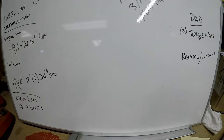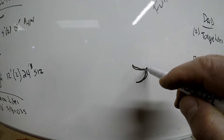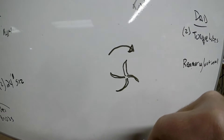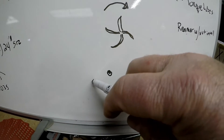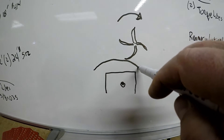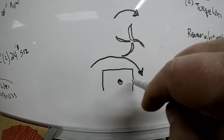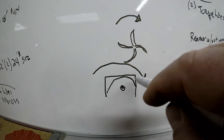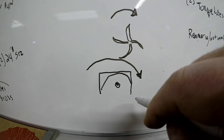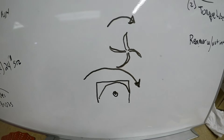Over at the whiteboard — you have to do this conventional milling. Looking down at your end mill, I'm using a four-fluted end mill with cutters. Here's the direction of rotation, here's our pin, here's our piece — you have to feed it into the workpiece in this direction; that's conventional milling into the radius. If you go the other way, those teeth are going to grab the workpiece and feed it into itself. It's not safe at all — you'll injure yourself, break your piece, and probably break the end mill as well.